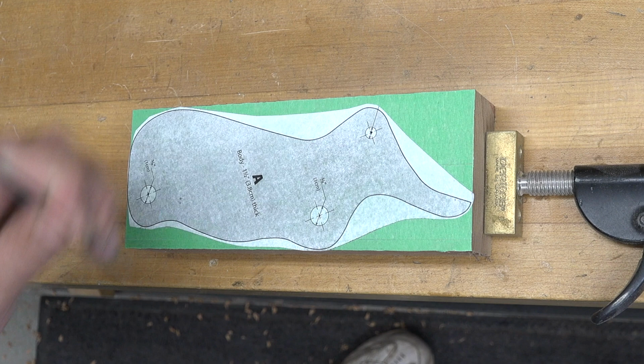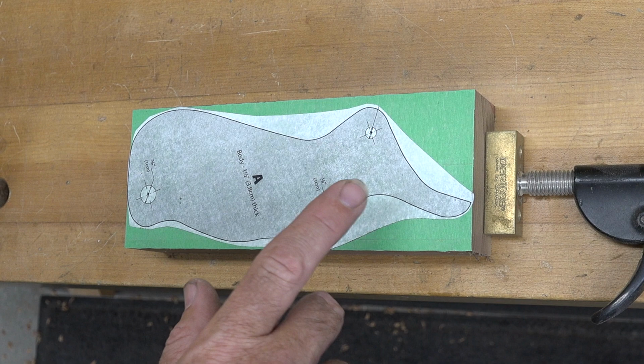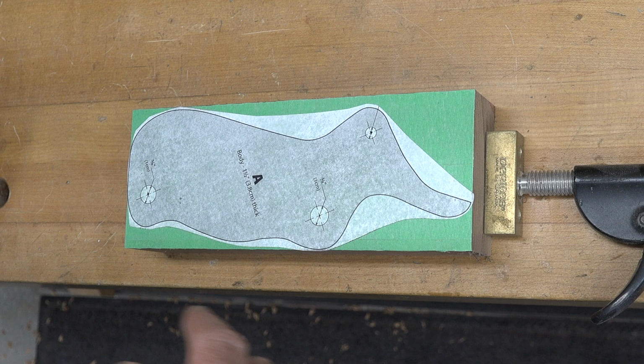The brad point with the center punch now has somewhere to go, and the edges get a much more crisp and clean cut due to the way the bits are designed. So brad points for wood, twist bits for metal. Either way, let's get these through holes drilled and then we can move on.